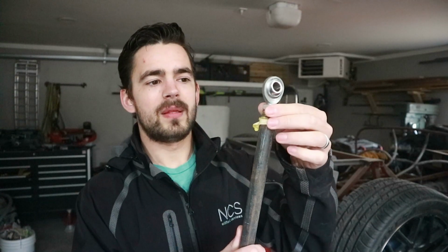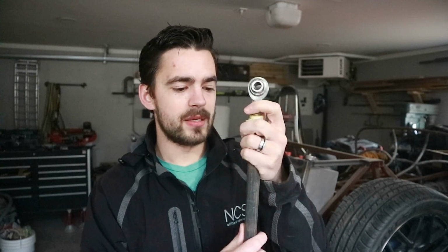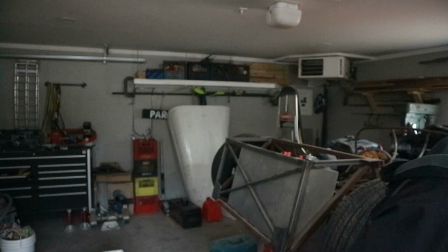we got some heim joints, and we're gonna use just some 1/2" gas line nipples, and just stick our heim joints in there, weld the lock nut for the heim joint onto the end, so we still have some adjustability on them, and use those, and then we can mock those in, build all our brackets and everything. I did some calculations. I think we need a 12" pipe nipple. These are 18s, so this one's not gonna work. So we need to go shopping. So let's do it.